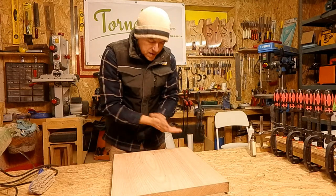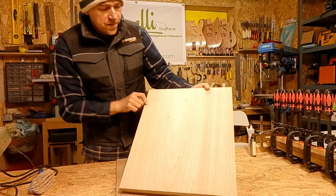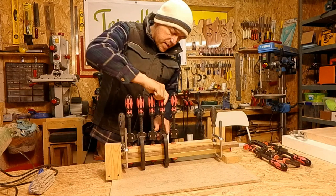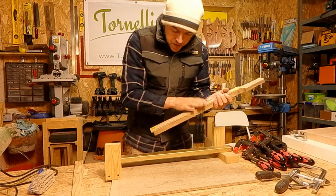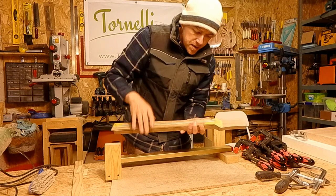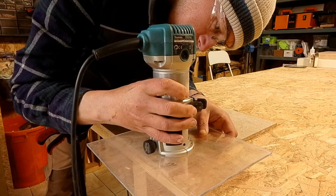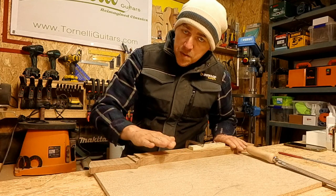That's ready to go — this is what I mean about the Okume. Every piece I prep is just beautiful. Time to unclamp the neck. It's nice and solid, hasn't moved at all. Let's get the fretboard flushed up and take care of the transition, then I can think about radiusing. I'm going to go with a 12-inch radius.